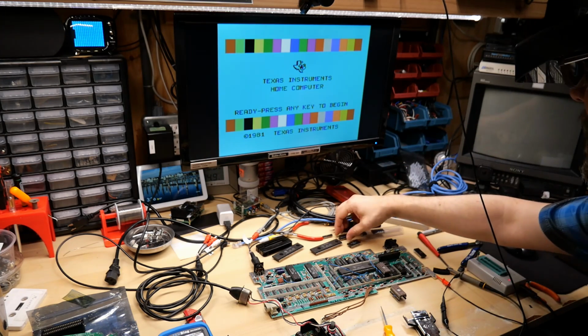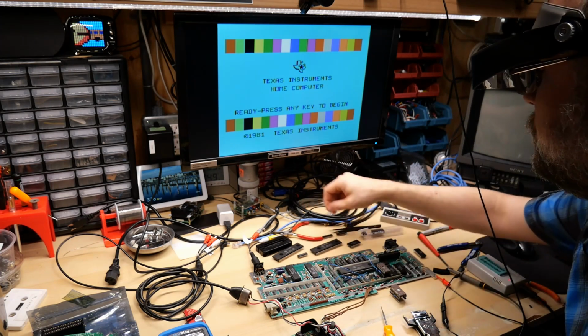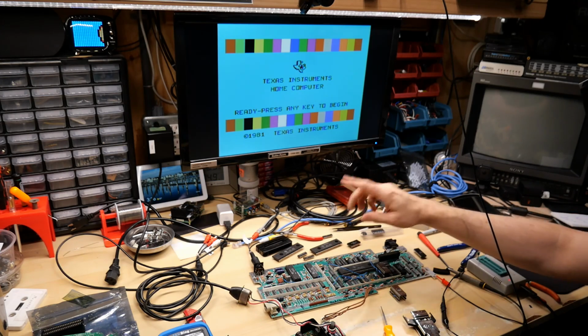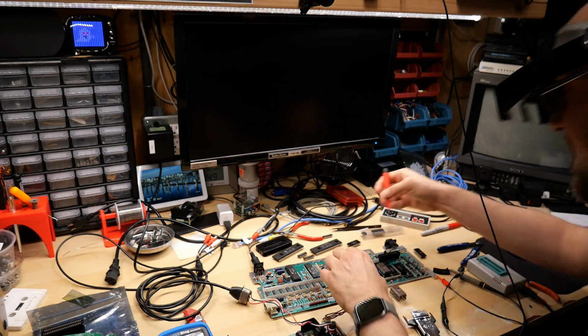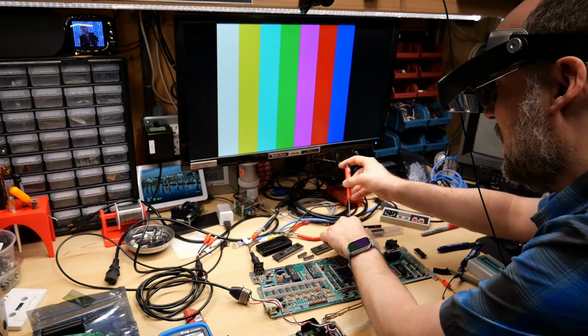So now I want to take and put the original 245 and 244 chips back in here. So the only one that I will have replaced is the 373, which I know is bad because I tested that one on the MiniPro and it did not appreciate getting 12 volts.